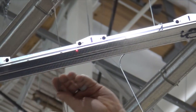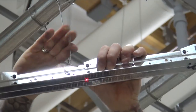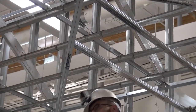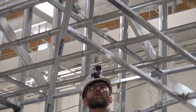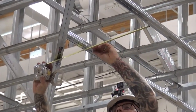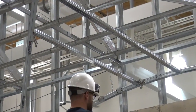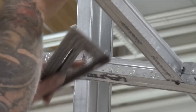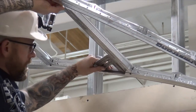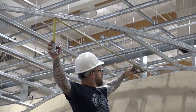Complete your final wire ties equilaterally at the proper heights along your mains, keeping all levels plumb with your laser. Now all we have to install are straight cross tees. These are what the drywall will screw to, not the curved main runners. Depending on your radius, you will typically install cross tees on 8 or 16 inch centers. Every tee will be cut to a different length as it travels down the slope of the groin and barrel main. Ensure your tees are square to the barrel mains at the perimeter before attachment.